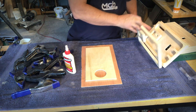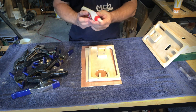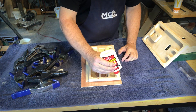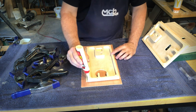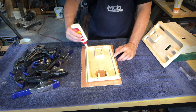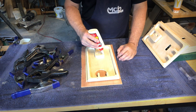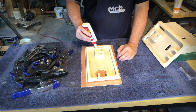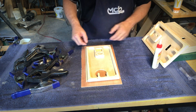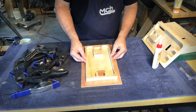What I'm going to do is take the first ring and put glue on the bottom side of the ring, then flip it over. One of the things that's really nice about this Titebond is the tip is kind of wide, so it allows you to apply the glue and get a nice little stream going — all the way around the perimeter, a little in here, a little on these arms. Then we come down and set it on the back plate.